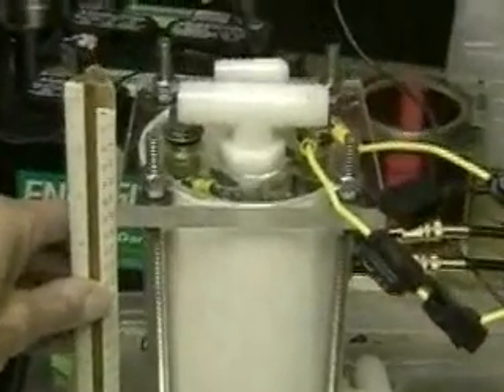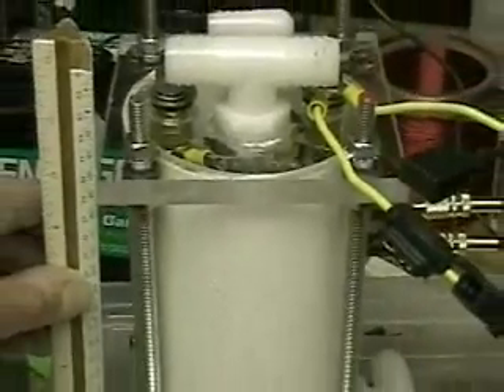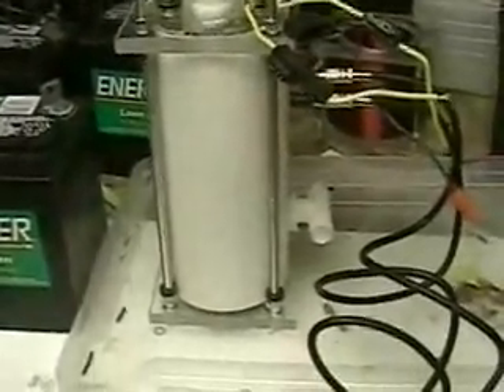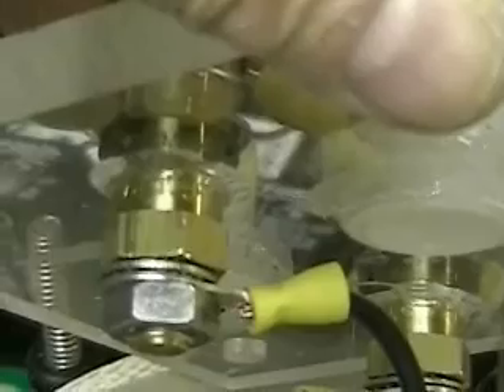There you can see the size — it's about 12 inches tall. If you took the system itself, it would be excellent to put in your lab to do tests. This unit is being sold as a lab test unit — you can do whatever you want with it. The unit will run up to 30 amps on a 12-volt battery using the plates that are in there without electrolytes. It takes a few minutes to get up to 30 amps as the water heats up. If you put electrolytes in the water, you will be in trouble because you will produce much, much more than 30 amps.